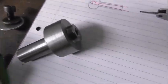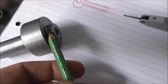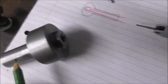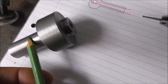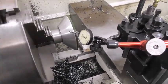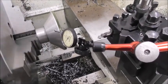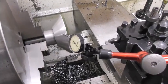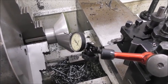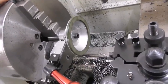And that's the arbor there. It's important that this little locating spigot — 20mm for the grinding wheel — is concentric, and that flat surface is at right angles to the main shaft, the shank that goes inside the lathe or milling machine. Let me show you the grinding wheel body run-out. That's nearly 0.3 of a millimetre — about 11 thou run-out. That's a serious imbalance and vibration to the grinding wheel spindle. So I can tip the top slide round on the angle and just skim that true, and I bet the inside's out as well.